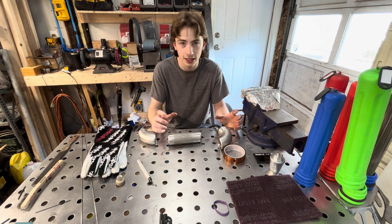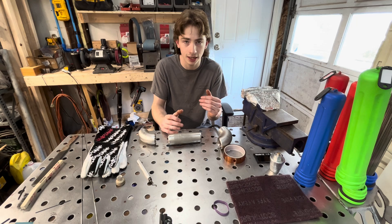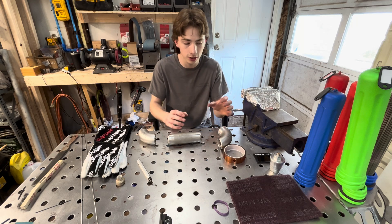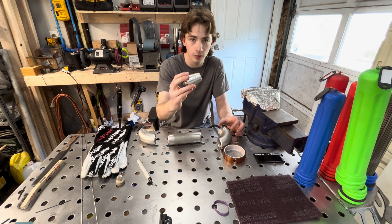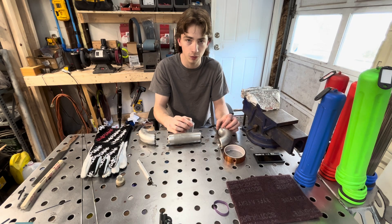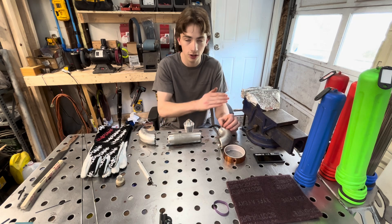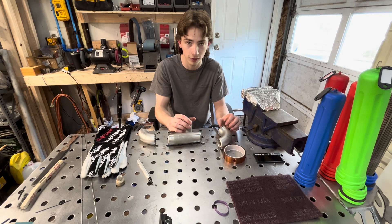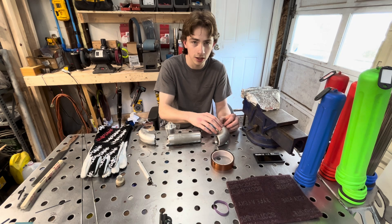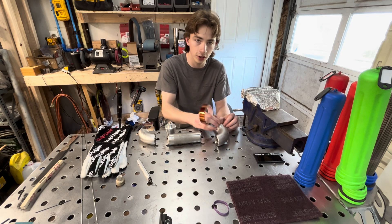For the purge, it's pretty simple — run the bottle at about 10 CFH, though depending on part size you may want to drop that down for smaller parts. We're using aluminum purge plugs. I don't have the TIGesthetics silicone purge plugs in this size; those are a great option if you're an adequate distance from the welded area, but schedule 10 pipe does not conform to the purge plug the way 16-gauge will.